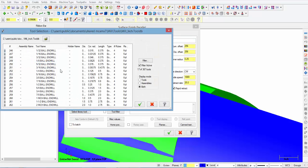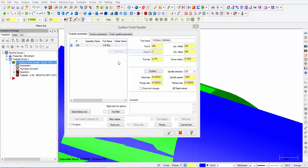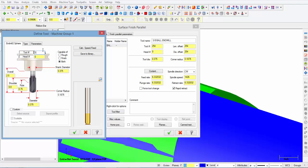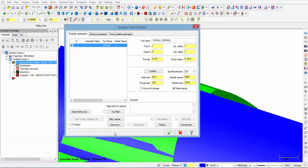We're going to pick select library and we're looking at ball end mills — we're going to pick a 3/8 ball end mill for this operation. Right clicking on it, we'll call it tool number one. On the parameters we're going to feed it at 80 inches a minute, plunge at 20, retract at 100, with a spindle speed of 4000 RPM. We'll put a check mark in force tool change and in the comments section we're going to put 3D surface.